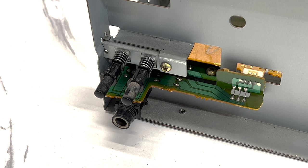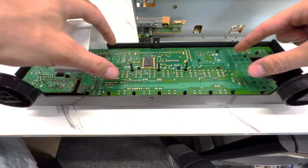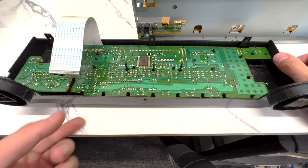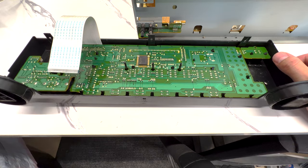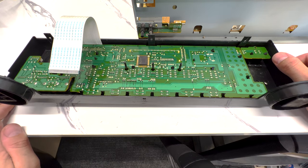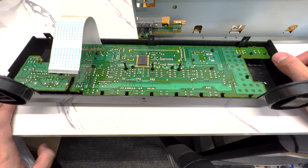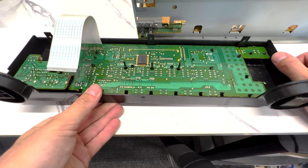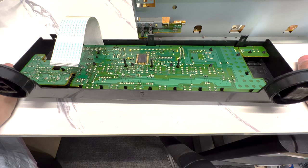The board was held in with all these little plastic tabs — spent some time pulling them all out. Taking a look at the switches in there, they're all sealed. There was just some gummy stuff; I wiped them up and now the switches are clean and free. They were all sealed switches, so they can't be serviced. I think we're ready to reassemble it, then we're going to test it by hooking it up to the oscilloscope, doing a frequency sweep, and checking the output — making sure we get a clean output on speaker A and on speaker B, which was the troubled channel.